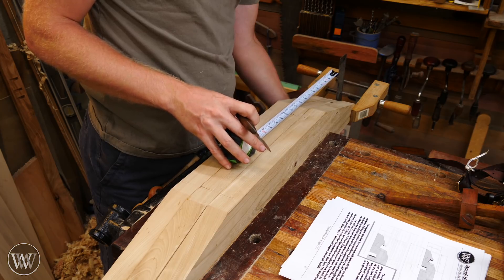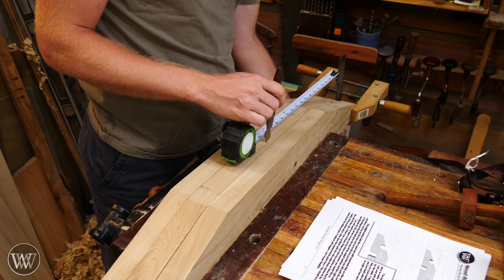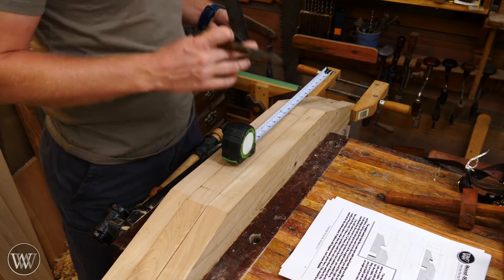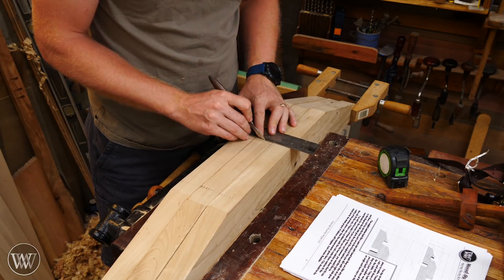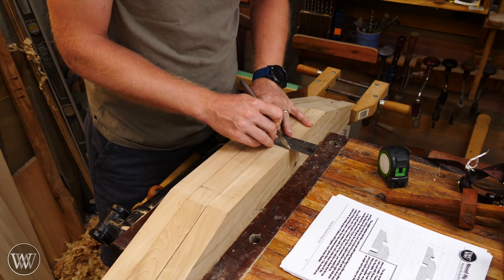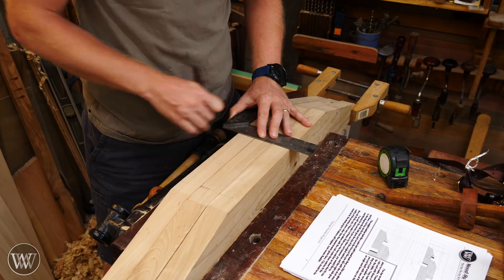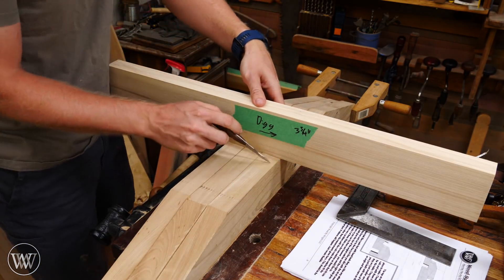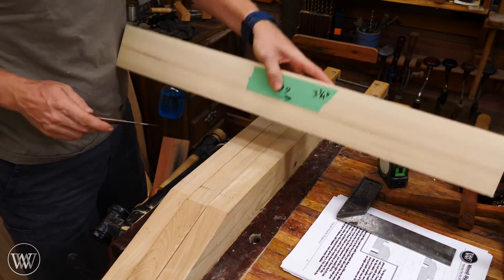The first thing I need to do is measure in from the end. I have a square on the end and a tape measure coming off of it so I know exactly where to make the first mark. Once I have that first mark made, I can square it off and run all the way across all three pieces so I have the same mark at the same location on all three. Then I'm going to bring over an actual board to know the actual thickness — not just the measurement I have in the plans — so that if there's any variation in the boards, I'll be making the correct width.